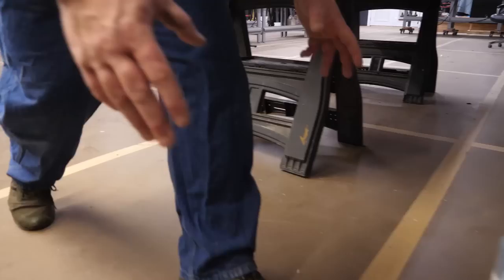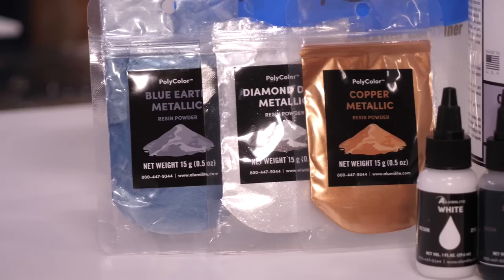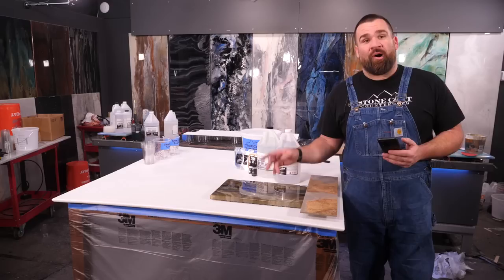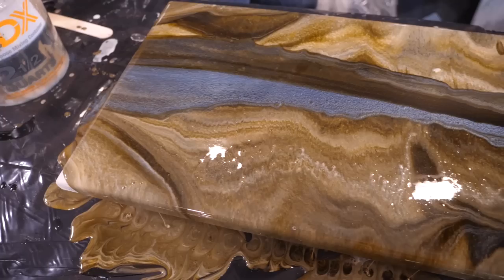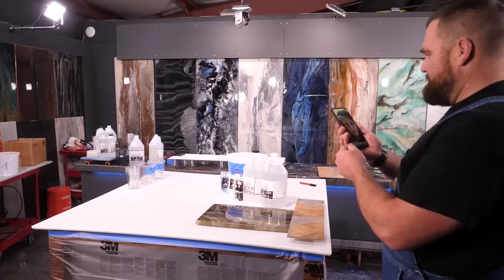During the winter months, to help with mixing and air bubble release, warm the epoxy bottles in front of a space heater for 15 to 20 minutes. The sample is nice and dry — I'm getting my wife on the phone to make sure she likes it before proceeding. She confirms: it's beautiful. Recipe approved — we're off to the races. Art Coat is a one-to-one ratio epoxy by volume, not weight. I'm going to mix up this kit, divide it into mixing cups, tint that epoxy individually, pour it back into the mixing bucket, and then pour my countertop right out of that bucket.